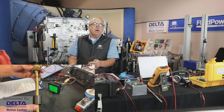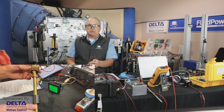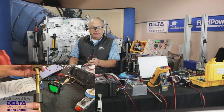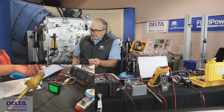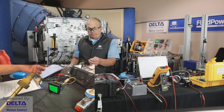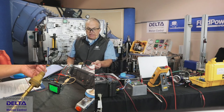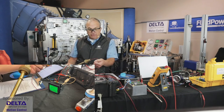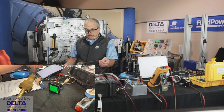What if we are oil charging accumulators, or what if we are discharging accumulators back into the hydraulic system? What if there's a leak somewhere out on the plant floor and we can detect that by noticing that the level is dropping? And again, this is a type of instrument that could send the signal into a PLC. In this case, again, we chose a two-wire. We could have chosen a voltage, a 0 to 10 volt voltage signal output to drive to our PLC, let's say. That's common, but so is 4 to 20 milliamps in the industrial environment, perhaps even more common. So this two-wire 4 to 20 milliamps control signal is used in a series control loop.